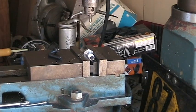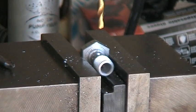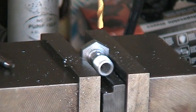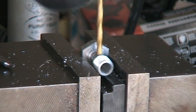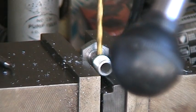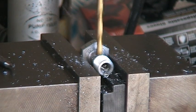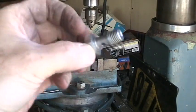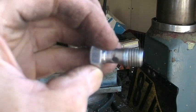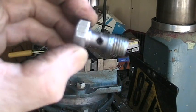Without moving it, I'm going to put the 0.177 drill in there — the number 16. That was the center drill. Got the center drill hole. Decided to drill straight on through — saved myself a step. So there I got the hole drilled through, and basically the bolt is finished. I have to deburr it a little bit, and work on the banjo part.